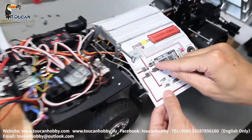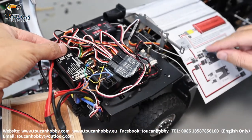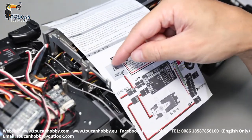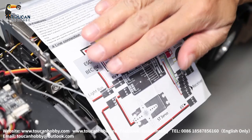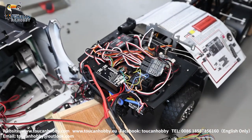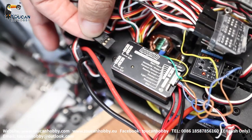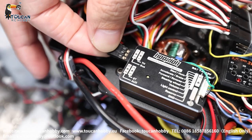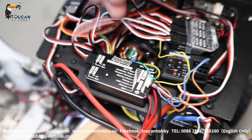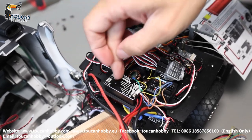But on the other side, on top, there is one more plug — it's from ESC. So 6V from a receiver or ESC, anyway, you can connect the power drive ESC directly to here, not battery — that's the ESC plug. So now it is already powered on, I will switch on the sound system. Without the ESC plug on top, the board will go dead. So with ESC also powered on, you can see it activate. That's from ESC or any receiver plug, any function, 6V to activate it.